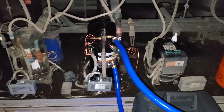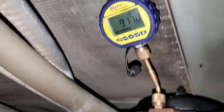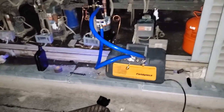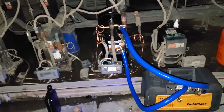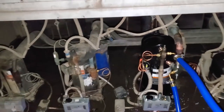The system this big, I wouldn't be the least bit surprised if we got leaks, but we'll see. We are getting there. It's at 917, so we made it under 1,000 — that's a plus. So we're almost there. Got our dryer mounted. Everything's not as straight as I'd like it to be, but you can only do so much when it's probably 8 or 9 o'clock at night now. It is times like these that I do appreciate these big vacuum hoses — they really do make it go a lot faster and smoother, especially when you're under pressure. So we've still got to power this guy on, charge it up, and then we've got to make sure the phase rotation is correct because this is a three-phase scroll.